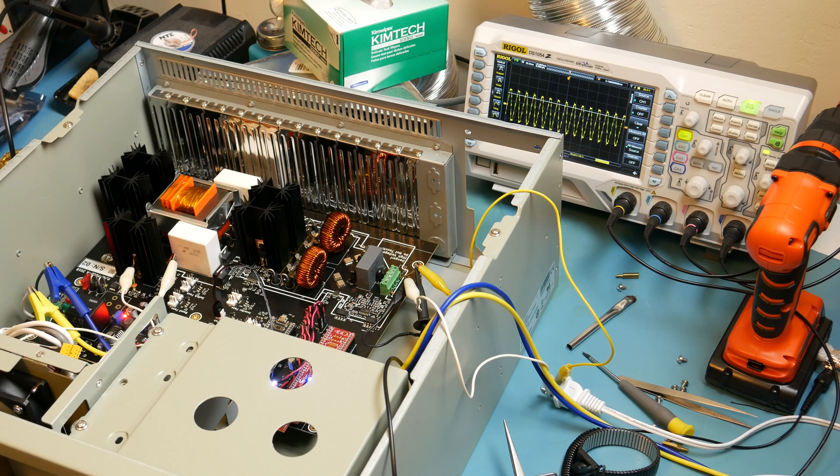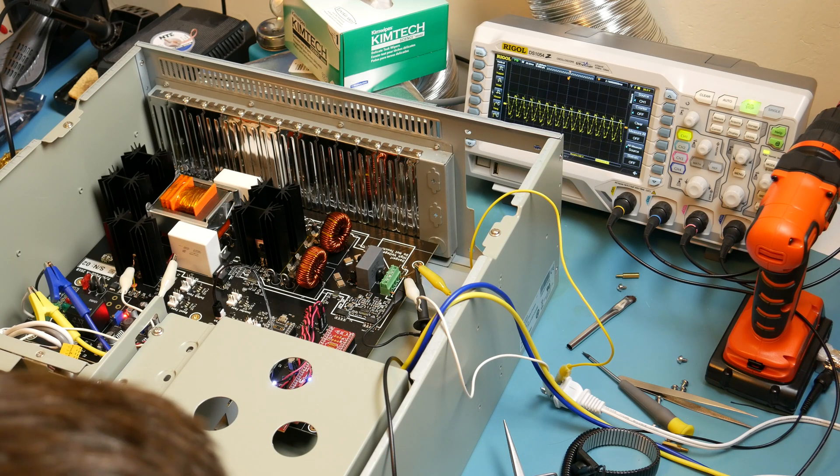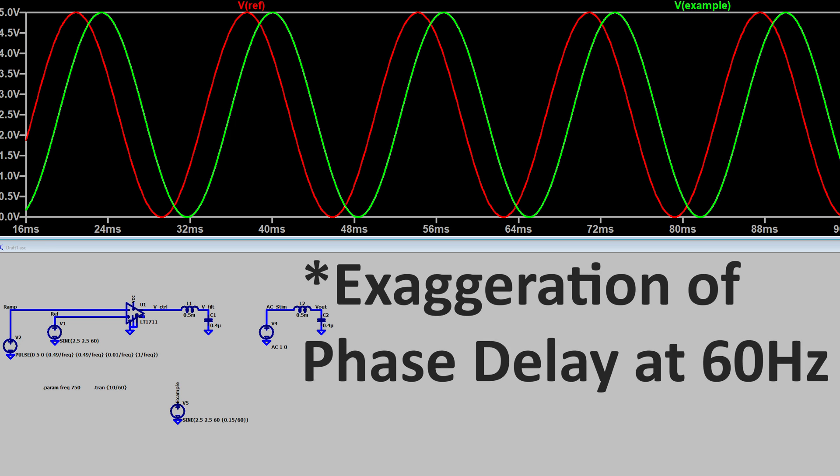Here's what that looked like. See all that funky garbage? See that terrible sine wave? Here's what you're seeing: the control loop screaming 'the output's way too small, crank it up!' followed immediately by 'the output is way too large, turn it down,' over and over again. The output was truly 50 when we expected 0, 75 when we expected 130, negative 50 when we expected 0. Our control loop is constantly chasing the ideal measured value because the delay accounted for doesn't match the true phase delay of the system.